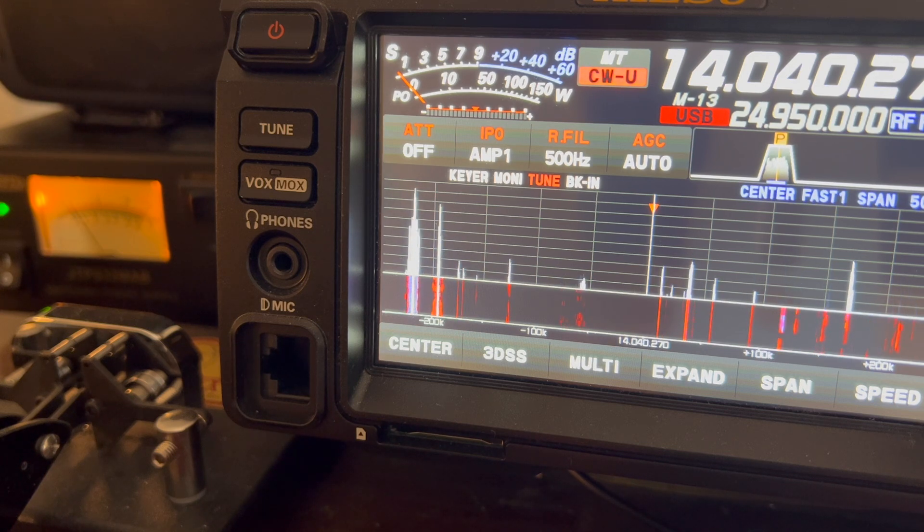But not necessarily like night and day. So we're beginning to see that having a good signal isn't all about power. However, if you apply the same math to 100 watts, a linear amp putting out 800 watts gives a signal strength increase of only 1.5 S units. A new 800 watt linear amp costs at least $1,500 in 2024 — so that's $1,125 for the first S unit and another $375 for the other half S unit. And I have never seen S units go on sale.